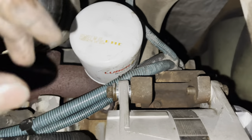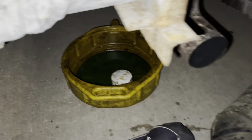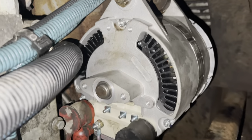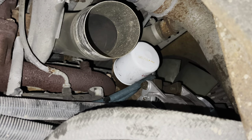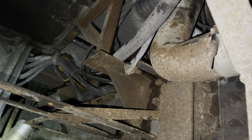Got the new coolant filter installed — that went fine. Lost a little bit of coolant but not too much; we'll top it off. Figured I'd do that while it was right there and easy to get to. The new alternator is in, all hooked up, all plugged in, new coolant filter is on and tight. I'm going to leave the air filter off a little bit so I can check for leaks easily and make sure the alternator is working properly. Got the belt on and all four batteries are reconnected. Let's go start it up and see how it works.